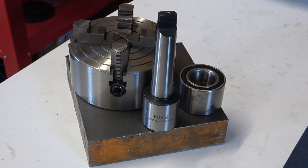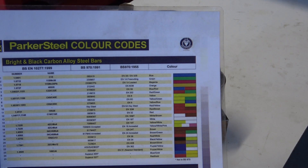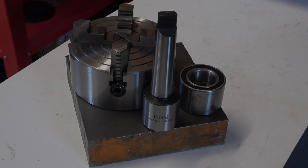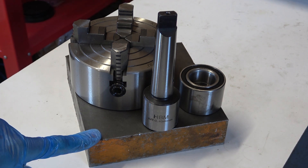So let's talk about the orange. Here's my metals chart — hopefully you can see an orange band there. It's EN8DM. When I look at what that is, it's EN8D but a free-cutting version. When I look at what that's for: a medium-tensile, weldable steel, fair resistance to wear, suitable for general engineering components. And what I should say is, I'm going to use this lump to make the backplates.